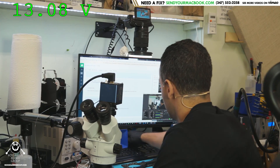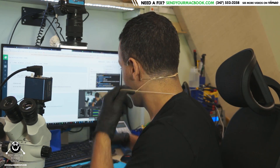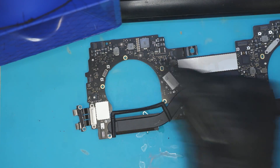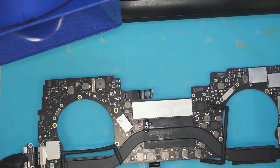So what was wrong with this MacBook? Well, this MacBook decided to spontaneously combust — perhaps it was sick and tired of being a MacBook and did the honorable thing. But we did drag it kicking and screaming back to life. This is something I see happening more and more with these A1706s. No liquid damage, no drop, no scratches, no scuffs. And it's always the same capacitors in that specific circuit — always one of the same two locations. I'm curious to figure out why.